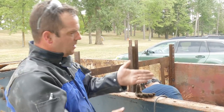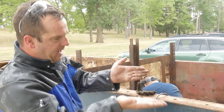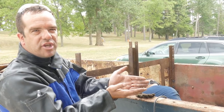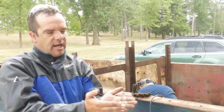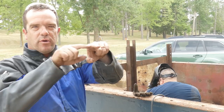Welds out. So the way that the housing is, this is the housing that comes down here, and the main hull is like it's in a fillet weld. So it's what we call an outside corner weld. So in a fillet weld, the two pieces overlap. In an outside corner, the actual square from the corner is left exposed.